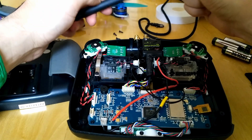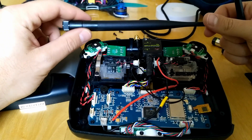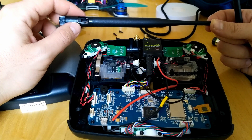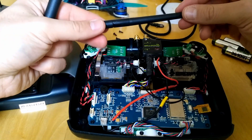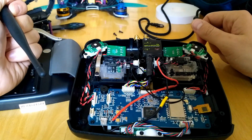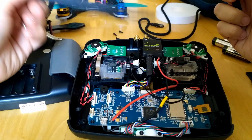I use the larger antenna for longer range and the smaller one for when I'm flying close. As you know, when you increase the dBi of your antenna, the coverage pattern changes — with higher dBi antennas the coverage is more like a donut shape, while with lower dBi antennas it's more like a bubble around you, so you don't have any gaps. That's pretty much it — two antennas and the booster.